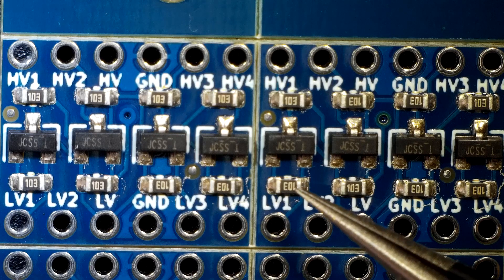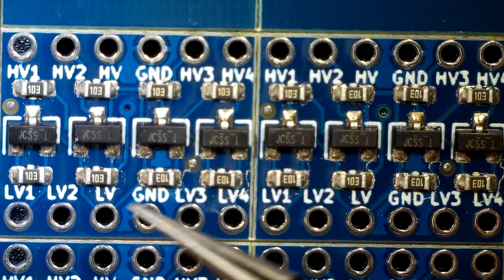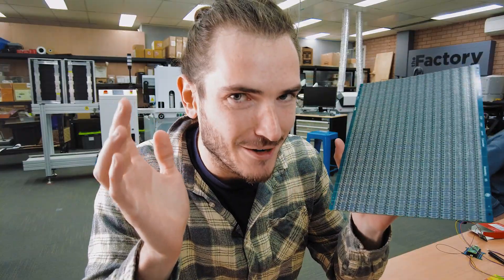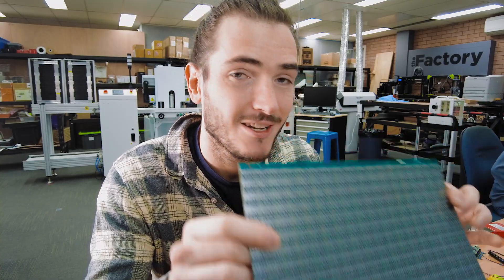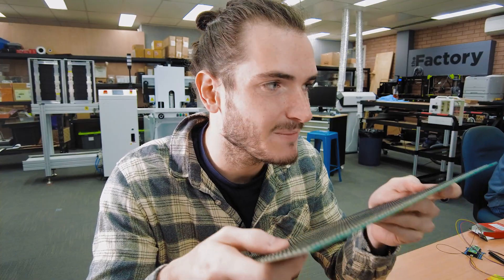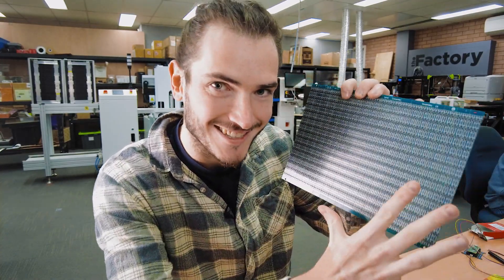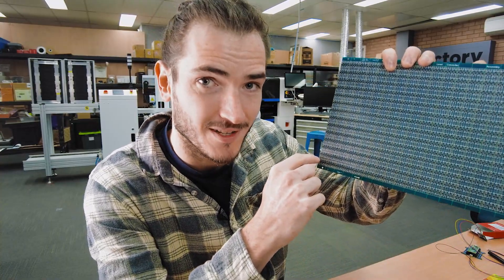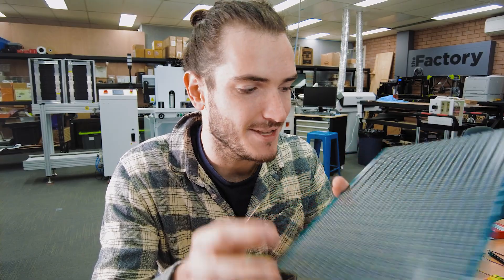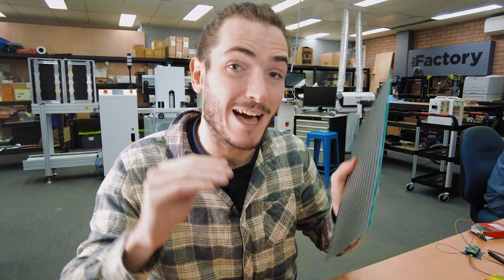Then in the next gantry movement we get another three transistors and five resistors. In the same number of gantry movements we've placed enough parts for one whole unit and one partial unit, and then the pattern just repeats. So those are my preliminary thoughts on this optimization that could really speed up how long it takes to place a panel like this. There are of course some trade-offs: it does make the pick-and-place file a lot bigger. Instead of just having the BOM for one unit, every part and location would have to be represented, making it a little trickier to manage. It's also quite likely that the component ordering would have to be either algorithmically or hand-tuned to get the parts in the right order to make best use of that nozzle configuration.